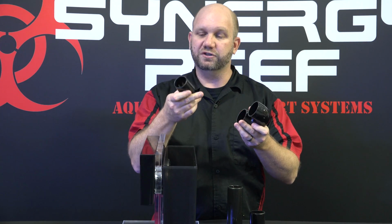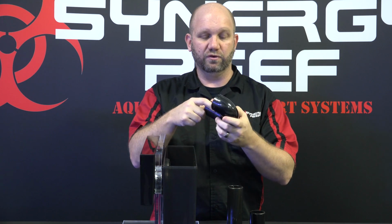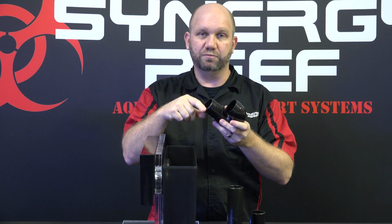We're going to take one of the U-pipes that's included with the overflow kit, and we're going to take the 2.5 inch piece and we're going to stick it inside of the U-pipe. Now you don't need to press this in too far. 1/4 inch is plenty because there's no glue on this, so it's just enough to be in there to hold it in place. The U-fitting does fit really tight, and this is normal. Again, as long as you've chamfered the edges on your pipe, then everything will slide in perfectly fine.